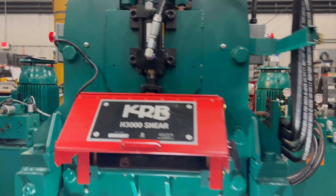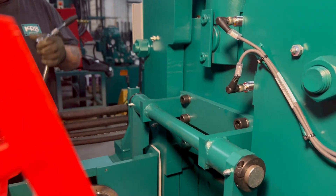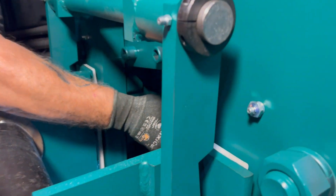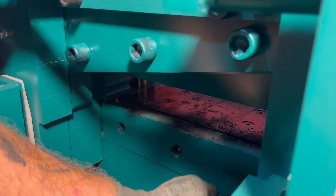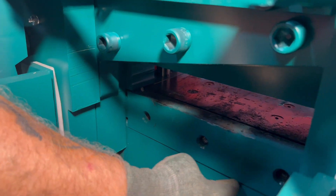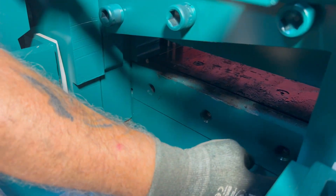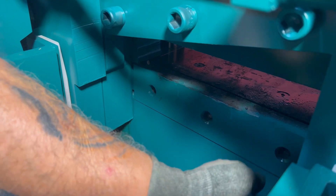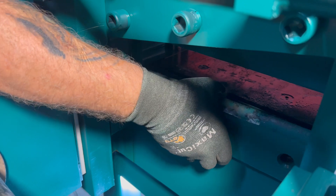Now you're going to want to walk around to the other side and flip up your red guard. Right down in here is where you can see the bottom blade. Sometimes with your blade being worn real bad you'll get little burrs along the edges right here, or sometimes across the bottom. You'll have to take a grinder or die grinder and get the burrs off. Sometimes these plates on the side get roughed up — just grind them down a little smooth. Obviously this is a fairly new shear here, so they'll be in better shape.